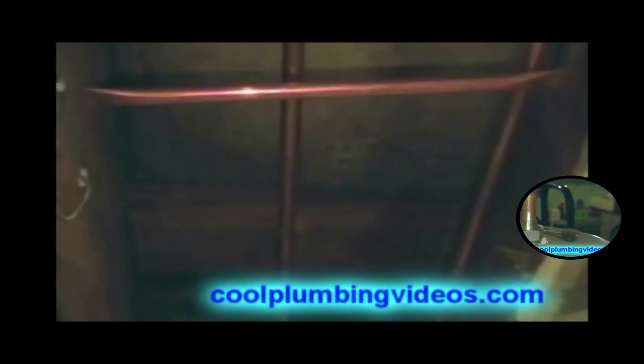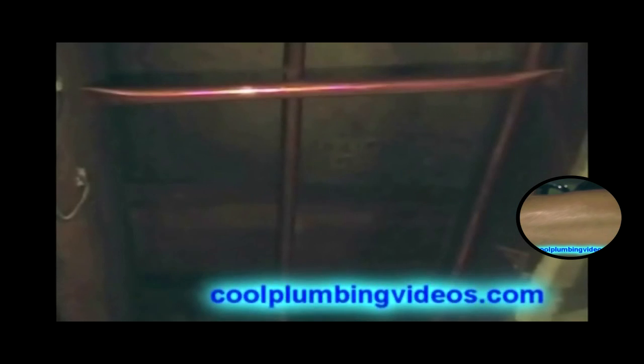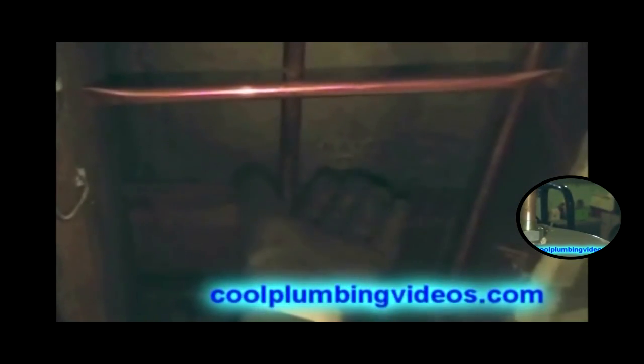The next trick we are going to do is solder those pieces in place. So we are going to put a little flux on this spot here and a little spot here. We are just going to heat it up and dab a little solder on it — a little flux on there — and it will keep it in place and it will not move on us.